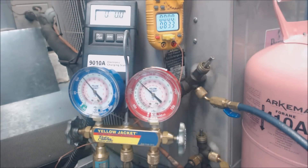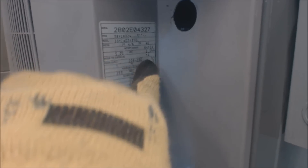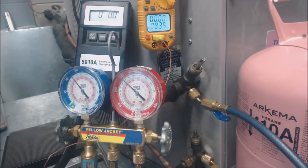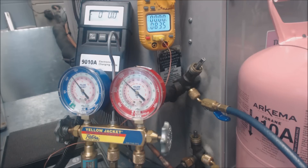What we're looking for on the rating plate up top — it states 14 degrees of subcooling. So 94°F minus 83.5°F gives us roughly 10.5 degrees of subcooling. Since the target is 14, we're going to add a little bit of refrigerant. I want to get it to about 15 degrees when we're all said and done.